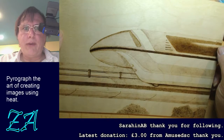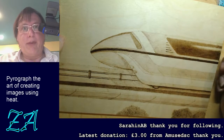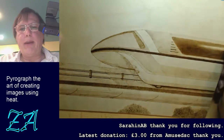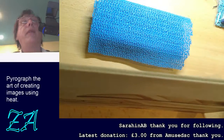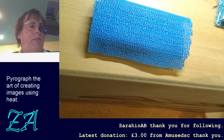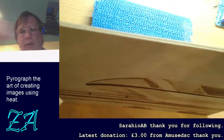Poplar is another wood which is slightly lighter. I've got some to try, I've never used it yet. It's quite difficult to get hold of in small sheets. This is birch, which is a really light wood, and it's plywood, and I'm using plywood on purpose. It's only about an eighth of an inch thick, I think. About 3 millimeters, something like that. So it's three ply, so a surface and a back, and just some mixed wood in the middle.